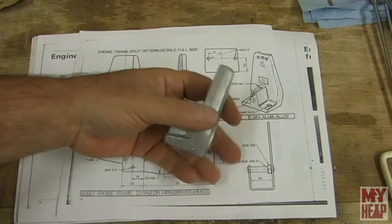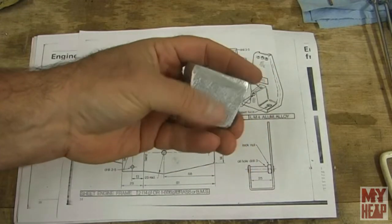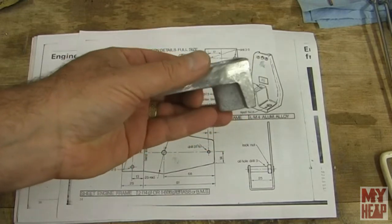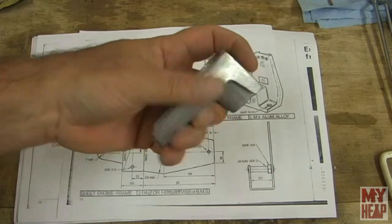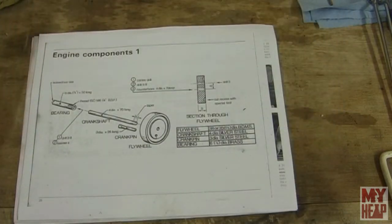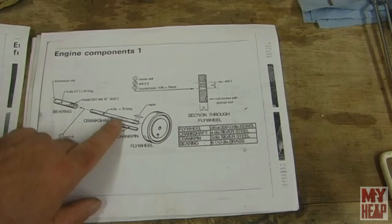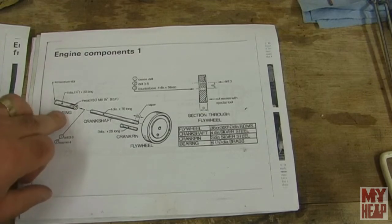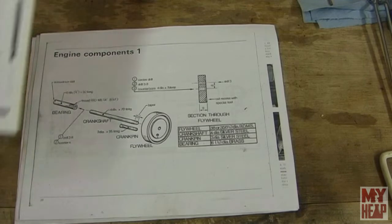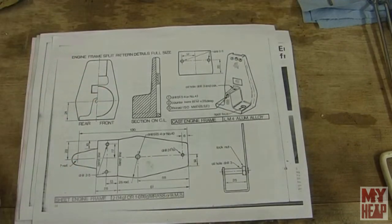All right, so to do this here, we're going to have to come up with some sort of angle plate on my mill or some way of clamping this down and fly cutting that, or milling it or whatever, so that this face here is square to that. And aside from that, maybe the next bit that can be done can start on the engine components. And here we have the flywheel, crank pin, crankshaft, and the bearing. So there's plenty to do, and I don't know what the next video will be on, but it's definitely going to be on something.